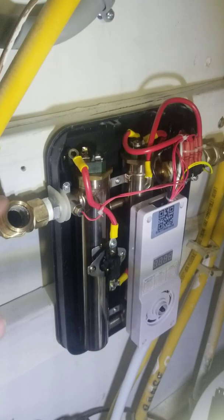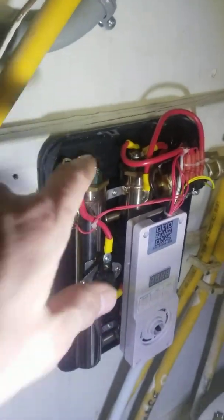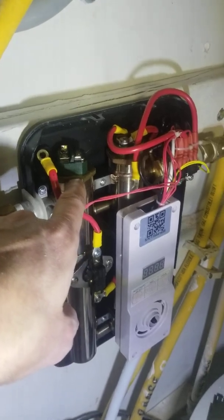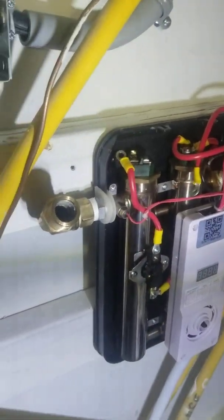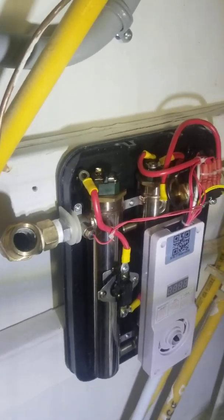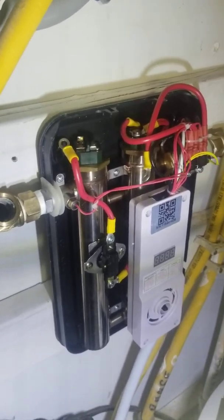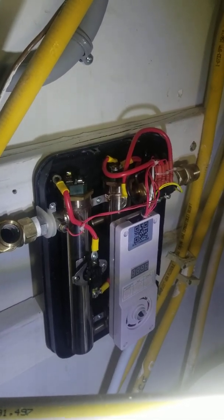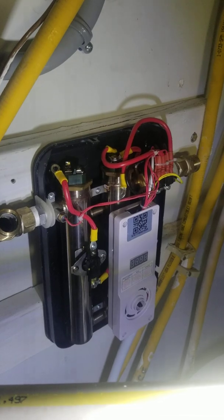So that's my plan. I'm not going to show more because I think that's pretty self-descriptive. Then of course reverse the process — put it back on, reconnect the fittings. I didn't even need to take the cover box off after all. Next time I'll just grab the pigtail cord, lift it off, put it back on, and make sure there are no leaks. Purge the air out by having all the spigots open until it runs without gurgling, then make sure it's working properly and hopefully won't make that noise anymore. I'll put a comment on YouTube to indicate whether or not I was successful. Take care, hope this helps you out, and God bless. Bye-bye.